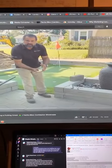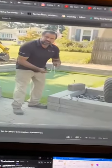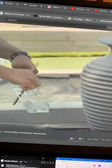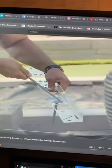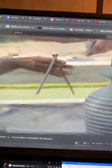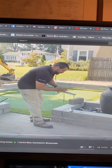Here it is. So the Pave Tool hybrid edging is this one here. It looks a lot like PVC edging, except it's made of aluminum. In a dense graded application, I would be using my spikes. And what's cool is they have this stitching technology that allows them to go in on an angle, which gives a better bite into that dense graded material.